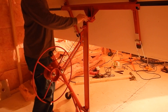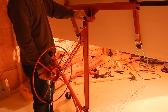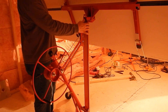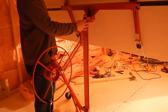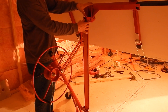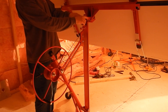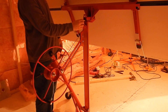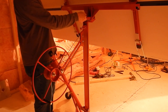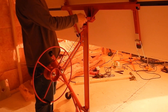Another thing is this little clasp right here. Make sure that when you tip the sheet back you always clasp it. This is an extra precaution — it's not to keep this flat during use. This clasp is only for transport when you have this taken apart, so that it does not slide out. This is really not your latch for when you're hanging drywall, only for transport. This is the one you use when you're working — you flip it over and lock it down so it doesn't tip on you.